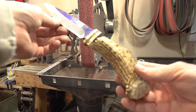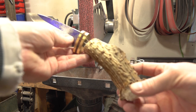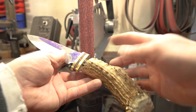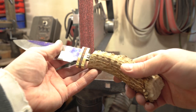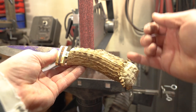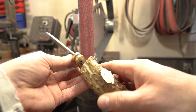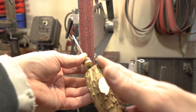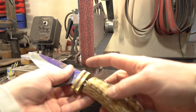Getting this pretty close. I've gotten to the point where I need to start straightening out these lines so when I start pushing it up more, it's going to be even with the guard material. As I'm digging out, I'm going to start flattening these areas, and same here — start grinding in this way so that as I push this up more it's going to fit up to the guard.